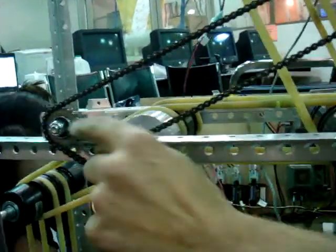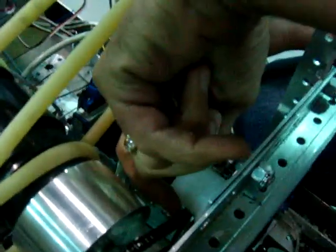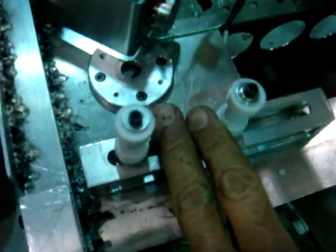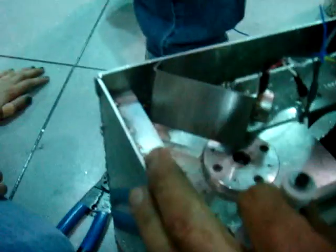This chain is tensioned over here by that idler wheel, which slides out. The chain down here is tensioned by this Teflon wheel inside here. And the other chain on the robot is the steering chain, and that's tensioned between these two wheels. And we need to be able to adjust the chain pressure, the lower and the upper shooter motors, towards the rear and towards the front of the robot